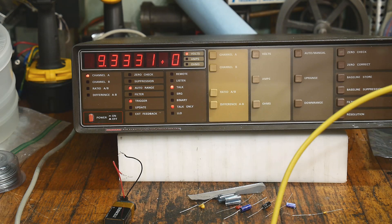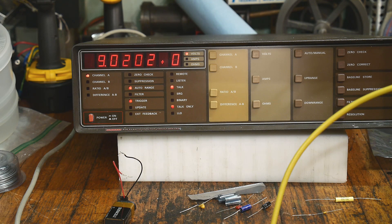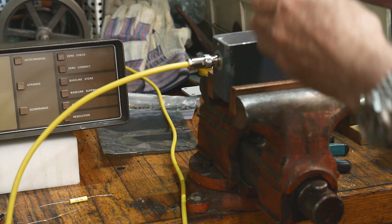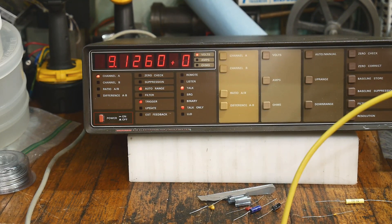So what I'm going to do is start with a capacitor — let's start with this 10 microfarad. I'll put in a 10 microfarad capacitor, and inside the box I'm going to take a 9-volt battery and charge the capacitor up with it. So there, I've charged it up, put the lid on the box, and we can take a look. We can see it was holding charge, and whatever leakage is in the capacitor we can see directly. This capacitor is sort of leaky. It's 10 microfarads and we put 9 volts on it.